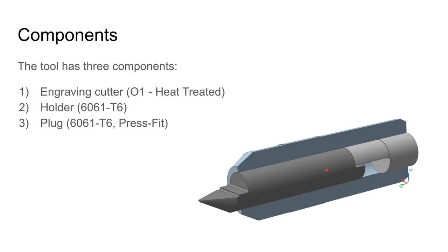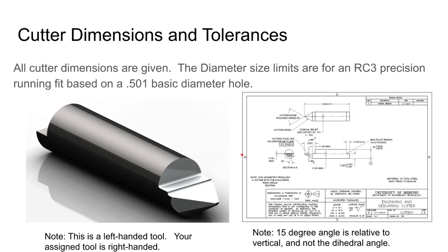We have three different shafts fitting into a hole, and what I want you to understand is that there's not just one design for a shaft fitting into a hole — these have three separate purposes. The front end needs to fit precisely: if you do this properly, the clearance is just barely big enough for air to come in and out and it'll make a really nice pop sound when you pull it out — that's a precision running fit. At the back end this is a force fit, where the plug diameter is actually larger than the hole. The last part is a loose running fit — it should go in without touching the walls at all.